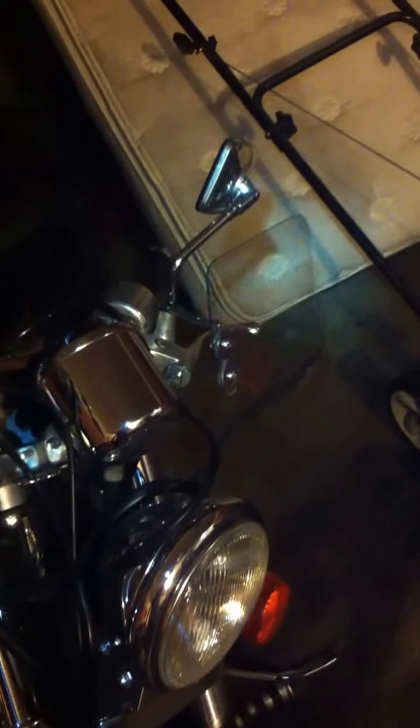Like I was saying, I used a cardboard sheet to figure out the template — whether I wanted it higher or lower. Once I figured it out, I poked the two holes through it where the L-bracket would go. I put this over the Lexan and drilled the two holes. That gave me the right and left positions — you can see right there — that got me where the holes should be.